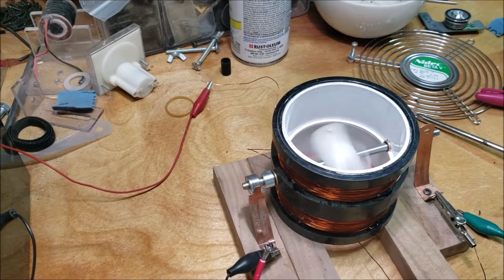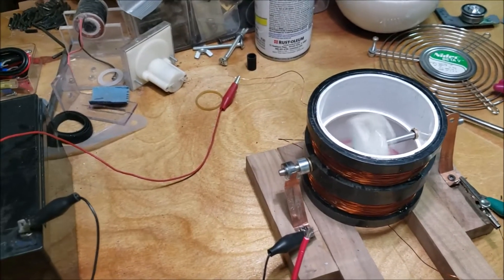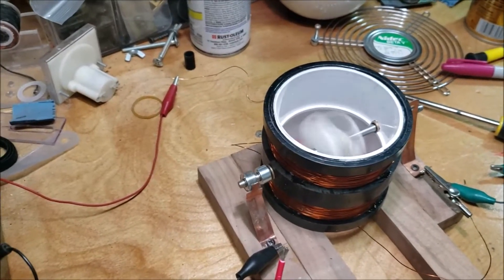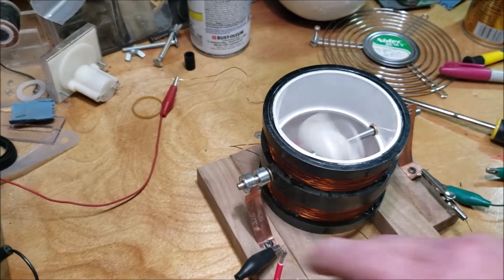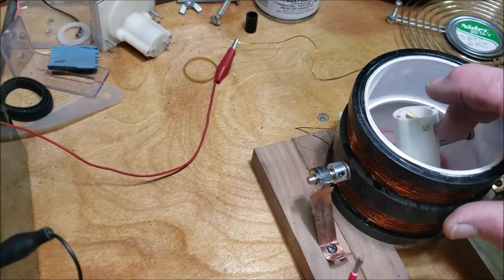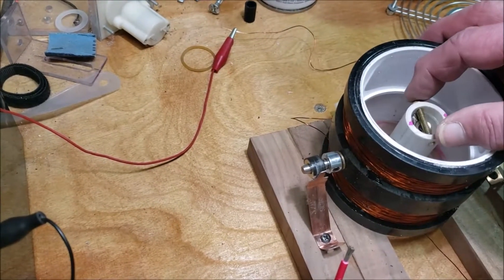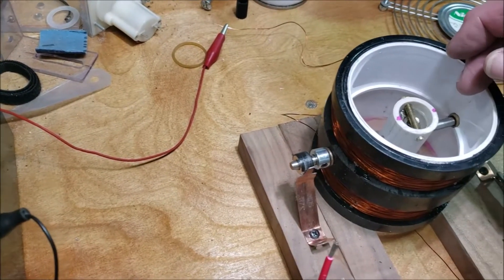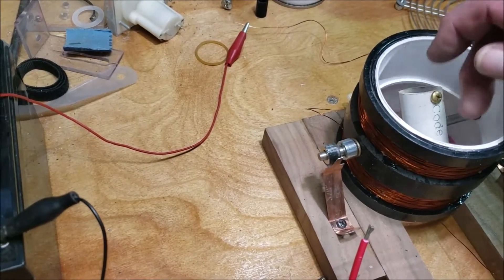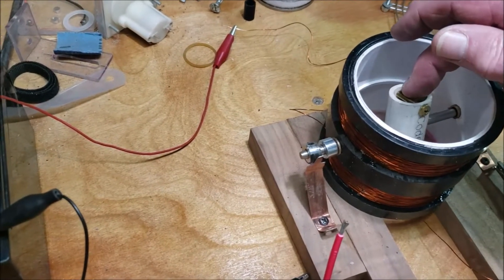I don't know if I should segment it or make the segment. I have it halfway, and I have it covering when the magnets are vertical, which seems to be the best way to do it. But I don't know if I have too much of the commutator covered.